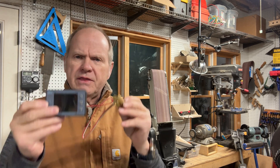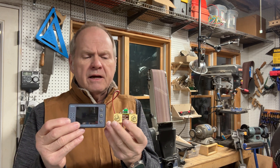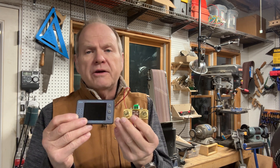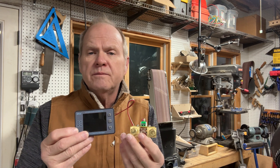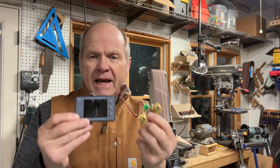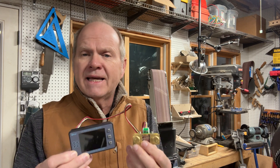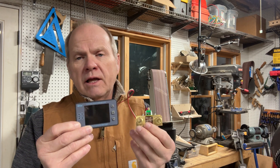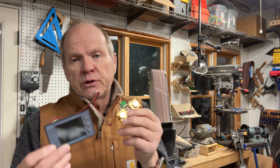Essentially what this thing is going to do is tabulate — it's adding up. When you start at 100% charge state, it accumulates how much you discharge it. As you plug things in, charge up a couple of phones and an iPad, run other devices — it measures the amount of current being pulled and tabulates a total used to display the percentage remaining. When you plug in a charger, that's essentially a reverse measurement — capacity going back in gets added back up. So if you charge the battery up properly, the meter will show 100%, and if you run it all the way down, it should go to zero percent.